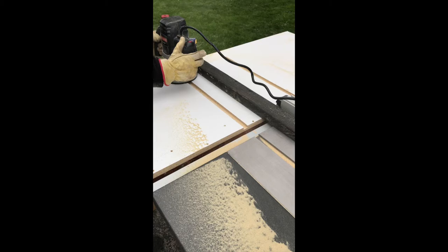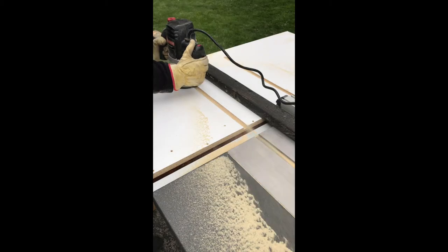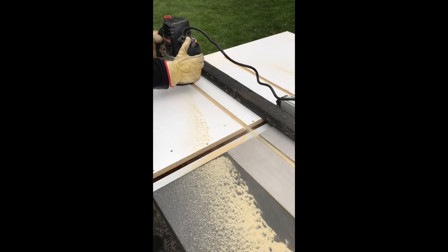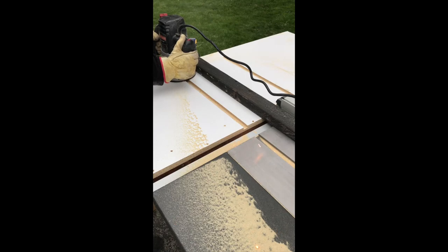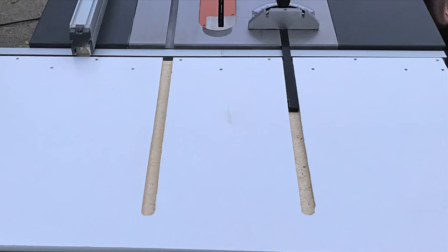Something went wrong — let's slow that down and watch it again. You can see I was very careful when laying out the screws on top of the table, but not as much when screwing in the piano hinge from underneath. There was a screw partially sticking out that I caught while routing the track extensions. Please be sure to check your layout and remove any screws potentially in the way prior to routing — unlike me.